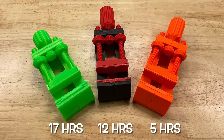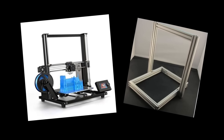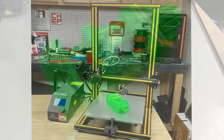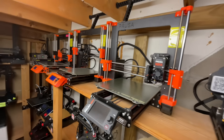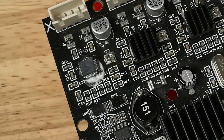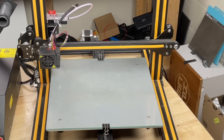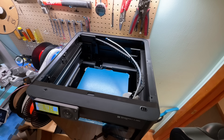So in eight years, how did 3D printing go from 17 hours down to 5 hours? Early 3D printers were built from wood or laser-cut acrylic — very fragile and not very stable. Soon, aluminum extrusions were used, making printers stronger and larger. The Creality CR10 was a popular printer using aluminum extrusions. The Prusa MK series of bed-slingers were also metal-framed and competed with the low-cost Ender 3. All these printers ran from a single board with a single microcontroller mostly running Marlin firmware. Silent TMC stepper drivers were added for smoother motion, and better belts, bearings, and linear rails became popular upgrades. Those early machines ran a Cartesian XYZ independent movement, which was later replaced by CoreXY motion systems with stiffer square frames.